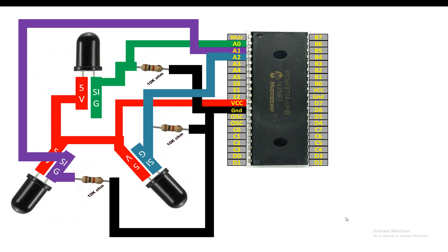In this way you have three RX LEDs — basically three fire detection sensors — connected to the PIC in a formation so we can get detection of fire from all 360 degrees, because one sensor only covers its front side and does not cover the back side. Now let's get to the output — how we are going to display it.